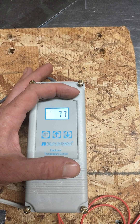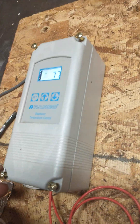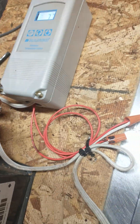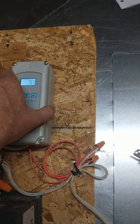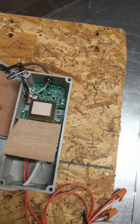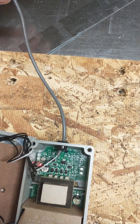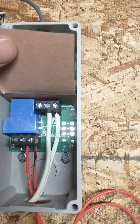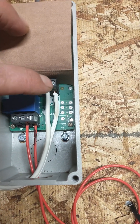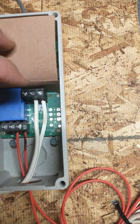What you're seeing behind that metal cover plate is just the front face — this whole little box is behind there. I've got it wired up here to an extension cord and powered over to a fan. Inside, you'll see the temperature probe coming out the top, the circuit board — that's the brains. The power to the controller is these two white wires: 120 volts in and neutral on the other side.